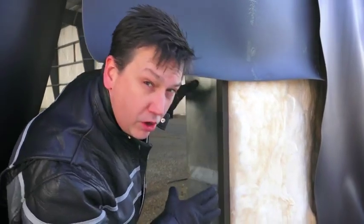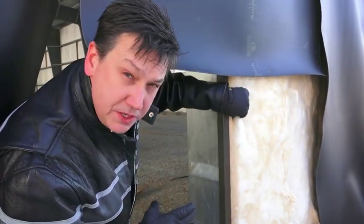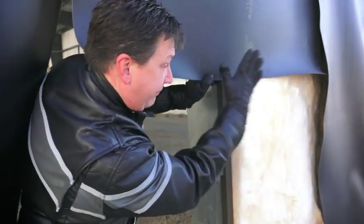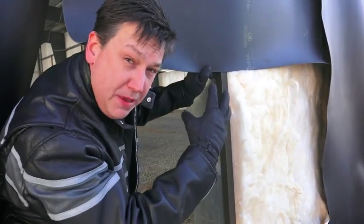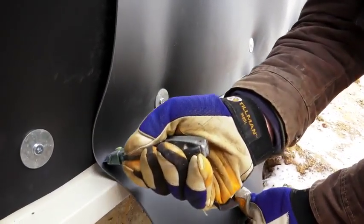Here at Aurora, we've got our wall frame assembly, then we have our absorption material that goes inside the studio, then our sound isolation material on the outer skin of the building, and the final outer skin pressed up against this. By doing this, this will damp the metal of the building so we won't get the ring from rain and sleet and wind.